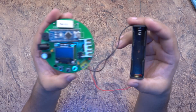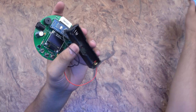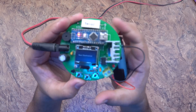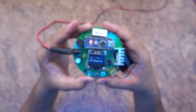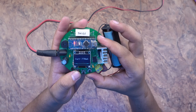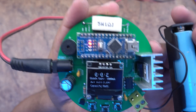Now let's test it with the battery holder. We have a cell — we attach it and connect it with power. When you power it on, the Maz Electronics logo appears and then it opens to the adjustment current screen. You have to adjust how much current — I will set it to 1000mA — and then you can start it and check the capacity.